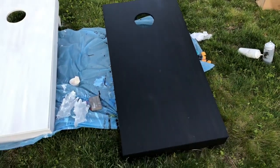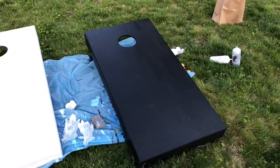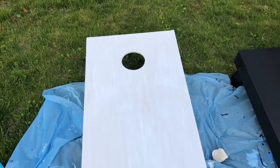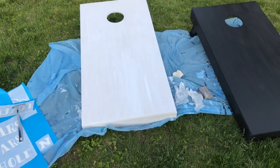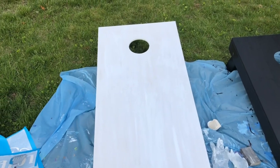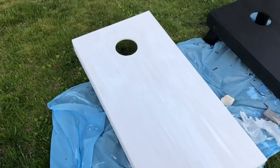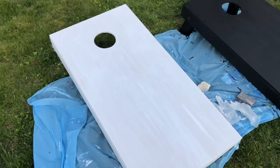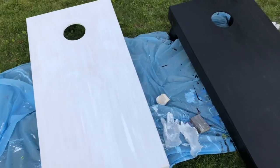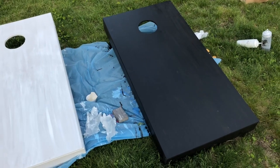The black board right here has three coats on it and I'm stopping with that. Three coats should really do enough and get rid of any streakiness. This white board I've been letting dry for probably 10 to 15 minutes and as you can see it's still streaky. So between your second and third coat you definitely want to let it dry for a good 10 to 15 minutes. If it's sunny out and you're doing this outside it's going to dry a lot faster. You can also use a hair dryer inside to help it dry faster. The third coat is really going to help smooth it all out and get rid of the streaky lines so it looks more solid. If you want to see some of the grain of the wood coming through, you can stop at two coats — it's totally up to you.